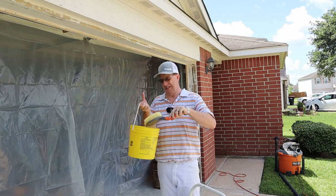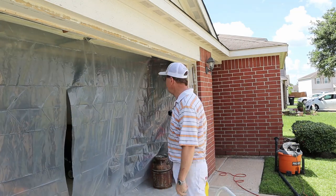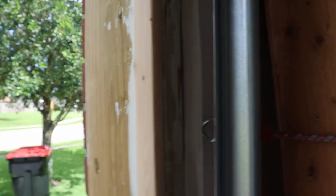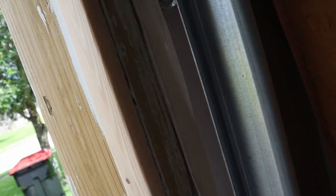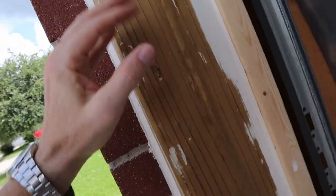I'm going to take this little brush here with just plain water, rinse it down, and wipe it down to get all the dust and stuff off. I'll come back behind with a towel and dry it. I'll let it set for about 20-30 minutes while I do some masking and then we'll put on the primer. Got my masking done — you can see it all along the top and all the way down. The reason I mask this all off is so when I primer, I don't want primer all over other stuff. You can see it's all dry, sanded, smooth, and no residue anywhere.